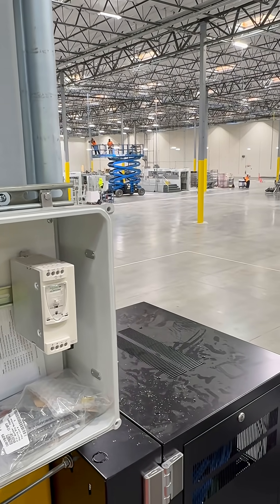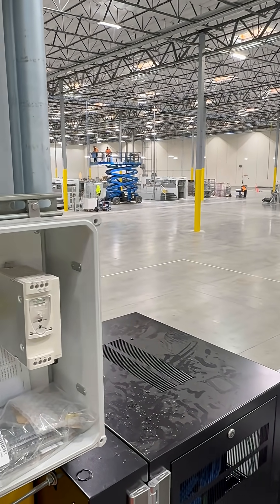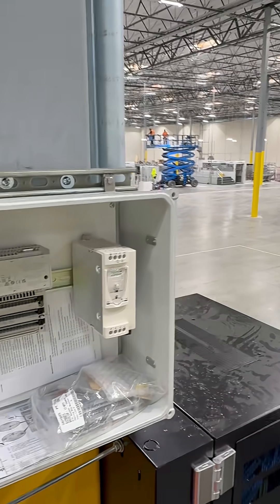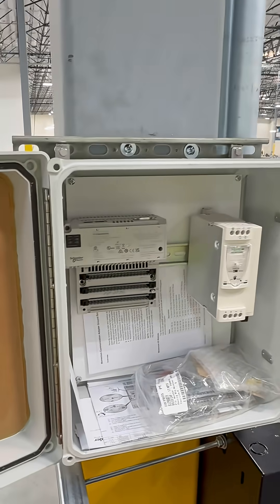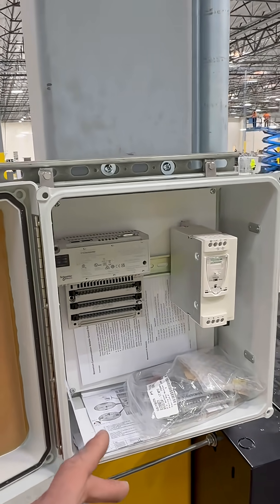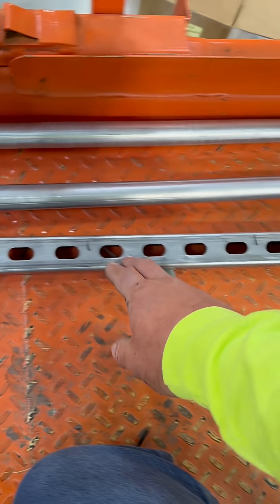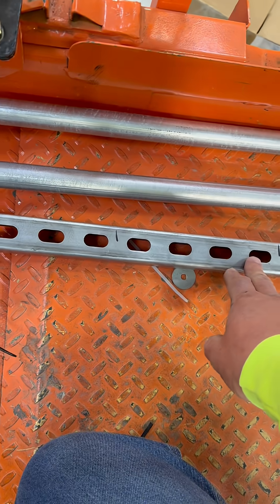We home run some 18-2s. We got conduits dropping down into each machine. We're gonna drop them in the machines and get a conduit up here to bring our 18-2 into the box. We're gonna cut three pieces of strut at eight inches to bring our pipe up.